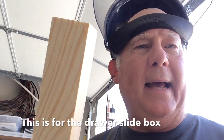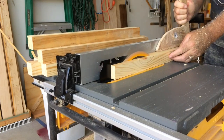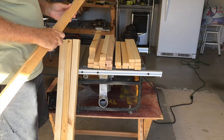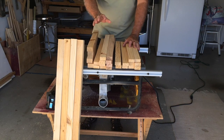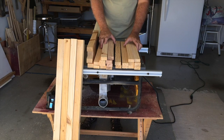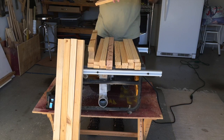Now I have the side inside brace pieces — they're inch and a half by the 2-by-4 width, about 1 and 3 eighths. I'm going to cut those to 3-quarter-inch thick. So I have my corner leg posts cut — they're 1.5-inch square by 41 inches long, and then I have the top inside box frames. These are the frames on the inside on which the drawers will sit. This is the skeleton. The next step is to cut dados in here for these pieces to fit in, and we'll join them up with pocket hole screws.